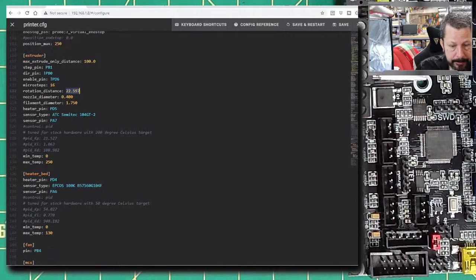In our particular case, we had changed out the hot end, and we also changed out the thermistor. So we put in the E3D cartridge thermistor versus the original glass thermistor. The values that you copy off of that configuration assume everything is stock: the extruder stock, the thermistor stock, the heater stock, everything's stock. And so if you've changed anything, then you do have to change that in your configuration. So I no longer had the thermistor that came with the Ender 3. I had that cartridge thermistor, and so I had to tell it I'm using the ATC Semitec 104GT-2 thermistor.